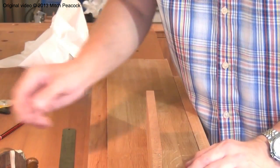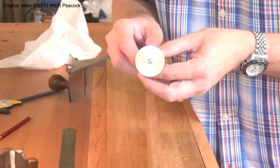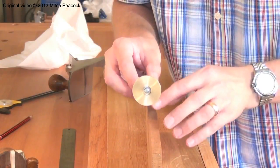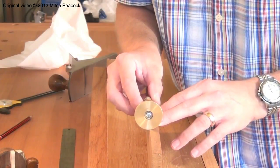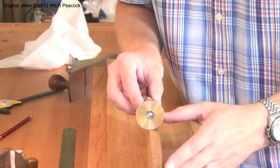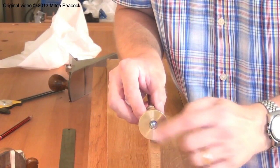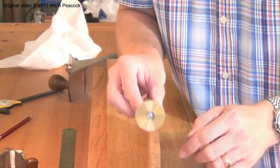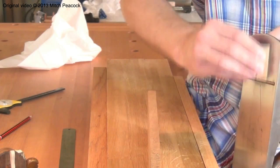And I think you can see, so we have a curved blade, much like the end of this. If we set it over the curve, more over the side we want to remove more from, we will be able to remove more material on that side than on this side. Just checking where our blade is coming through on our plane.